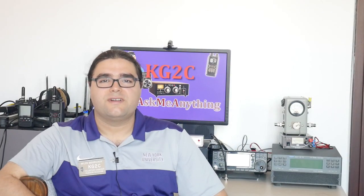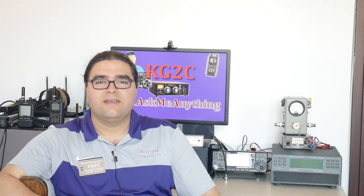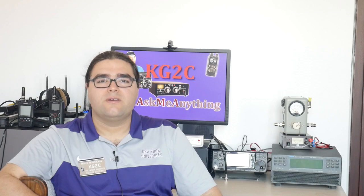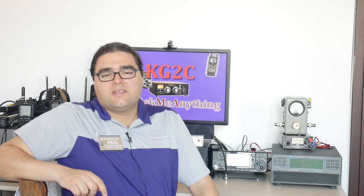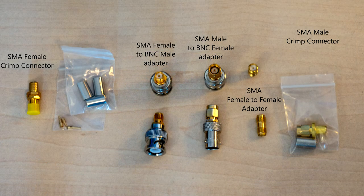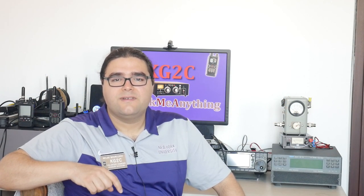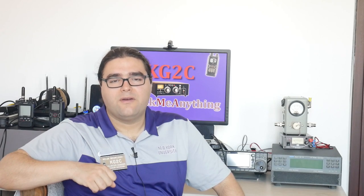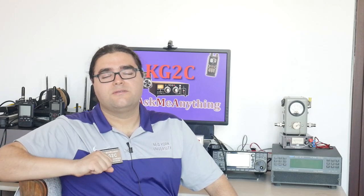Let's talk about the structure of SMA connectors. There's male and female, and there's normal polarity and reverse polarity. In amateur radio, you will normally encounter just the normal polarity variety. For normal polarity, you have a male and a female connector. The male connector screws on to the female connector and has a center pin. The female connector has the thread on the outside of the barrel and has a sleeve that accepts the center pin from the male connector. The male connector has the threading on the inside of the barrel, so it can screw on.